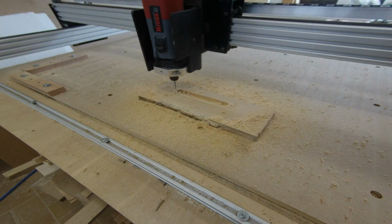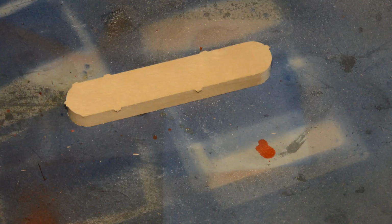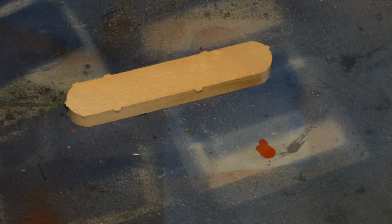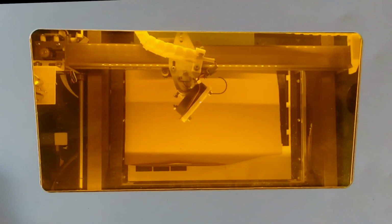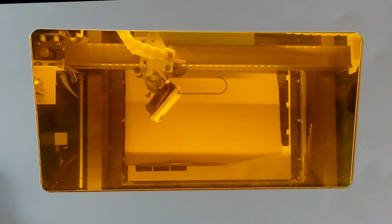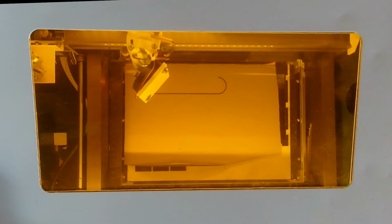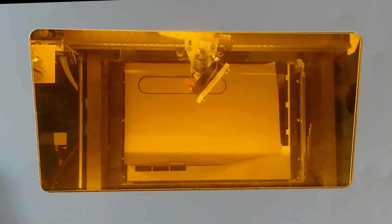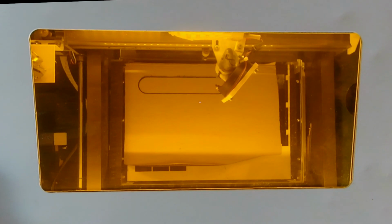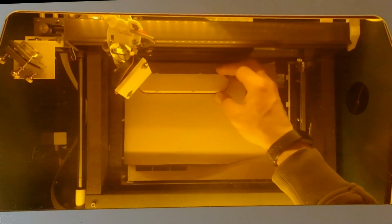Before we take the boxes to the laser cutter to engrave the name for the inlay, it gets one clear coat of spray lacquer. This way the pores are sealed and the excess superglue can be removed cleanly. To get the laser to focus on the right height, we remove part of the bed. With a scrap piece of plywood, the box is exactly the right height. The position of the box is marked on cardboard. The laser engraves the name even with the finest detail.